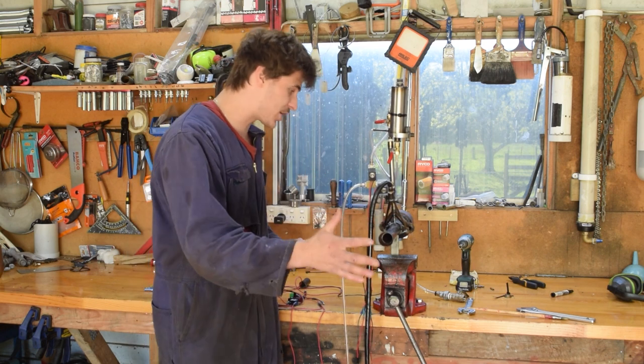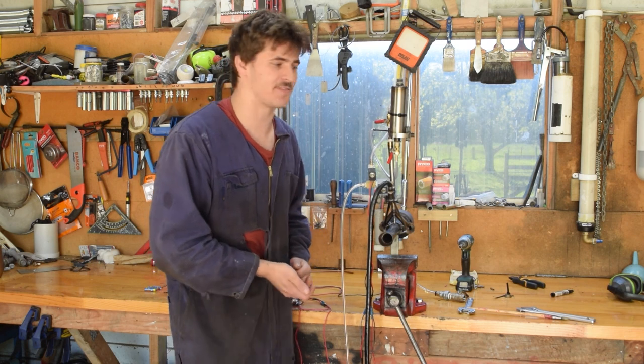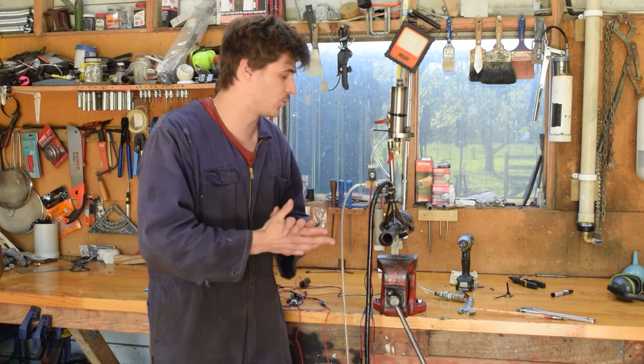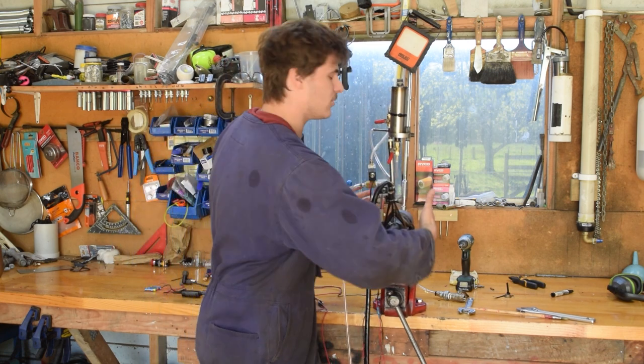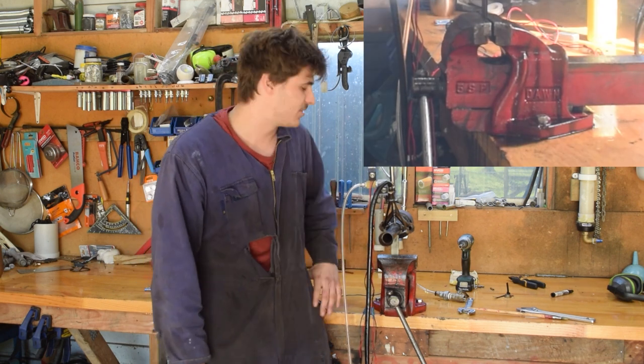That was a flaming success. Anyway, the liquid fuel made a huge difference. The frequency, the power, the heat, it was very much amplified. Now, I tested a whole bunch of liquid fuels, diesel, kerosene, and engine oil, and engine oil was the best by far. It was also the most sketchy, and I think that was because of the high viscosity. Not all of it made it into the engine, and it kind of just pooled around the very hot pulse jet, which is not ideal.